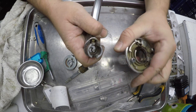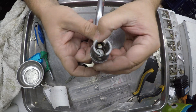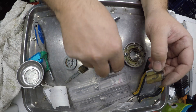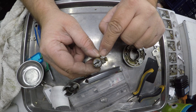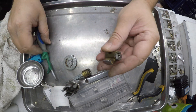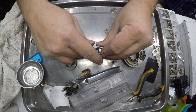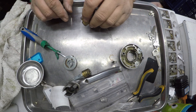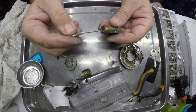We'll just lift off that outer rose — there's all sorts of dust in there, quite airtight, a lot of grease holding it on. And there's our cylinder. Now we've got the cylinder out, there's this little part here — take note of the way that goes. We'll take that off and take the circlip off the back of the cylinder.